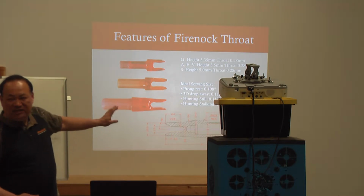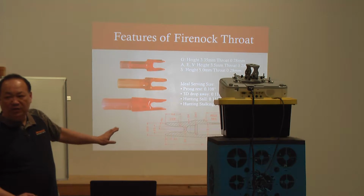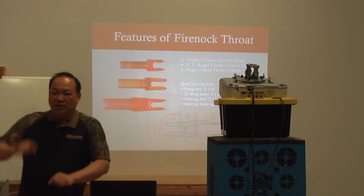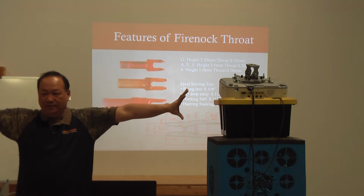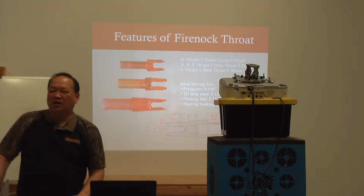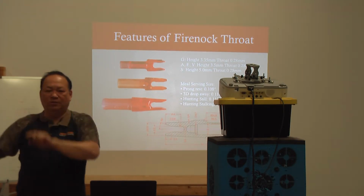Now to make things even worse, typical people who make nocks go through 4, 8, 16, 24 cavities. What does that mean? That means when you flow the nocks through those cavities, the mold usually does a center flow. Imagine the nocks are like that, all the way up to 16 or 24. The flow is coming from the middle and it goes out. Polycarbonate cures from the outside in. What is the curing time of this nock compared to this nock, from the center point to the outermost?